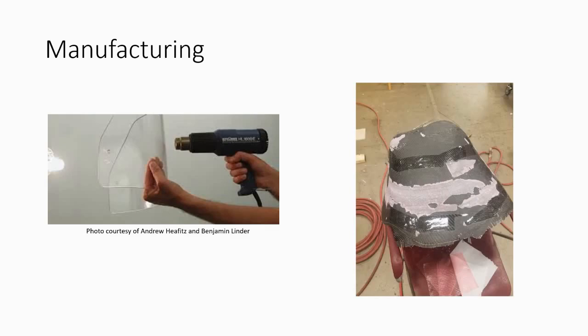The idea of bending and bolting a sheet in place was discarded, as this process would greatly involve stressing the sheet, which would make it not hold up as well during the crash. The vacuum former stands alone as the best option when regarding the end product.